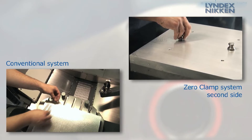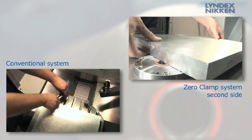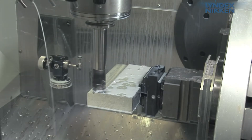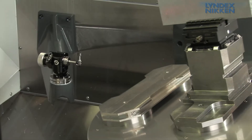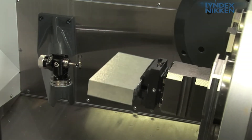The fastening of the workpiece with screws, the positioning by means of T-slot nuts, the alignment as well as the zero point determination are no longer applicable. Even a restart after an interruption of the machining cycle is possible without zeroing.